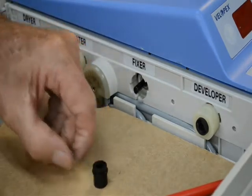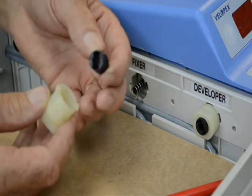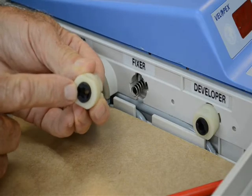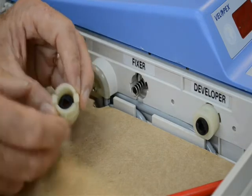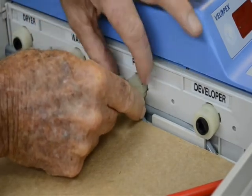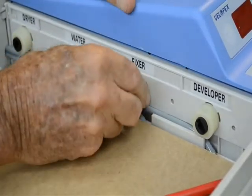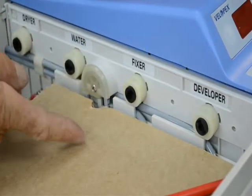The first piece we're going to put back in is our spring, which simply slides over the shaft. Then we take our drive dog and make sure that our bow-tie shape drops into the bonnet — that's the way it is reassembled. This has the face outward, and on the inside is a D-shape that goes on this shaft. Now we're going to line up those tabs at eight o'clock and two o'clock, right there. Then we take our finger and turn the drive dog until it engages with that D-shaft.